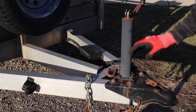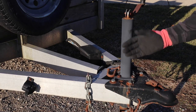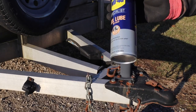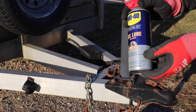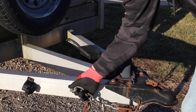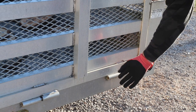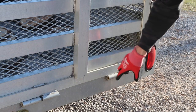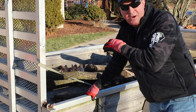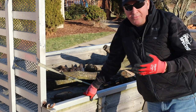When it comes to your crank hitch, this can be replaced, which I've done before. If it's not too worn but you feel some resistance, you can remove it, take it apart, and do some maintenance on the inside with some grease or gear lube. I've had good luck with this gel lube for metal-on-metal parts — it helps resist rust. For any moving parts that are starting to rust, apply that, and also check your chains making sure everything looks good. When it comes to your ramp, make sure that has some grease on it. This one doesn't have grease zerk fittings, so I'd lower the ramp, slide it off to the side, and apply grease for maximum life. Once I get the firewood out of here, I'll also go through and check my tie-down systems.